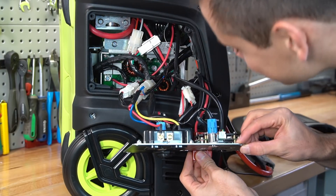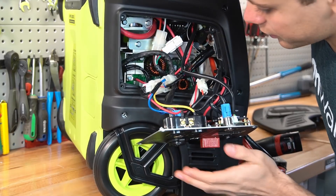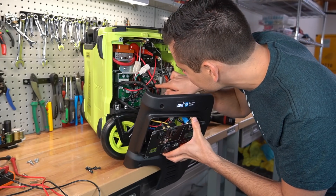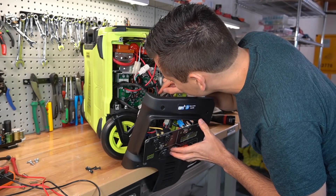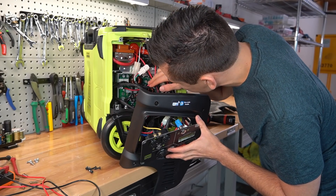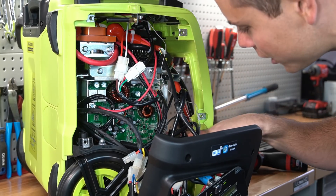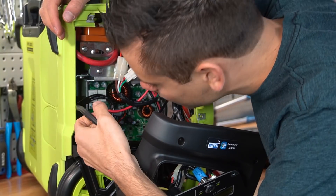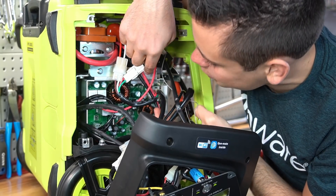There's a lot of stuff inside. The DC output is a blue and yellow wire. This is high voltage — do not do this at home, you can die. The inductor and circuit here go out to the solar input — this is the MPPT. The board actually looks good: it has conformal coating, some cheap capacitors but otherwise nice components. Up here is the Wi-Fi antenna that connects down to the module linking to your phone.